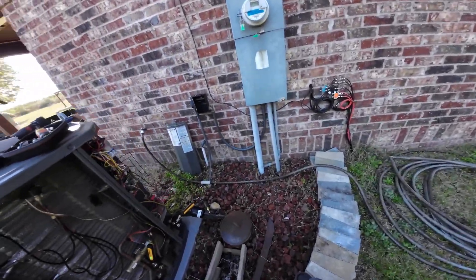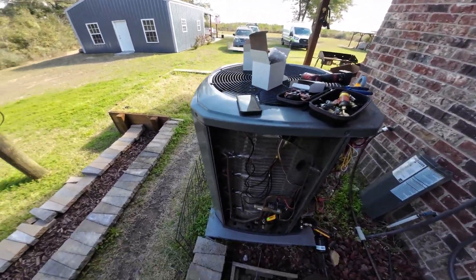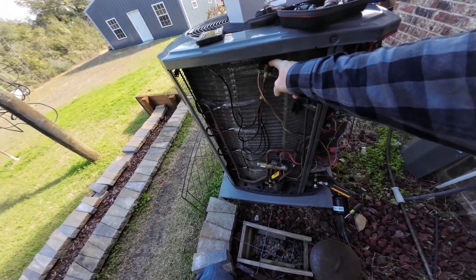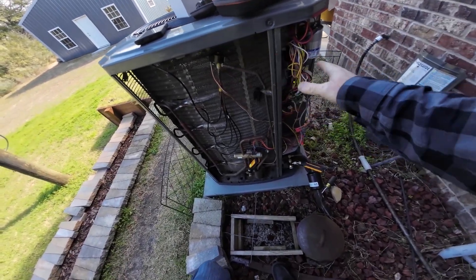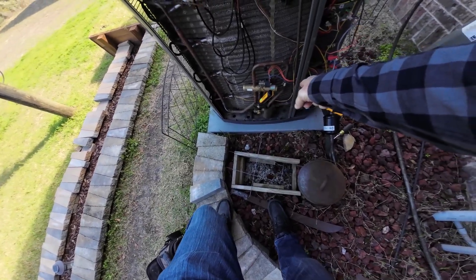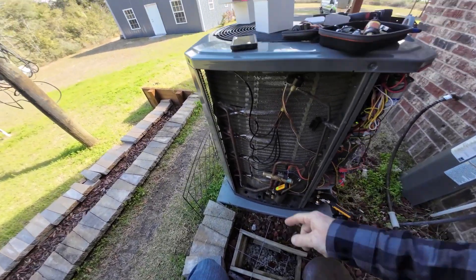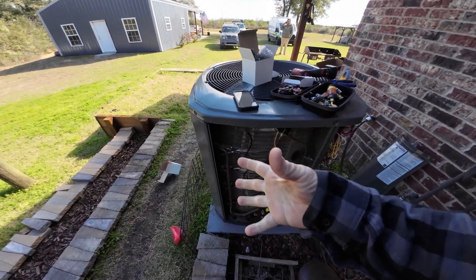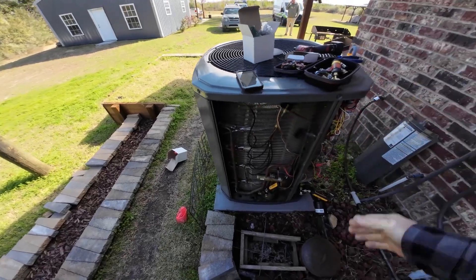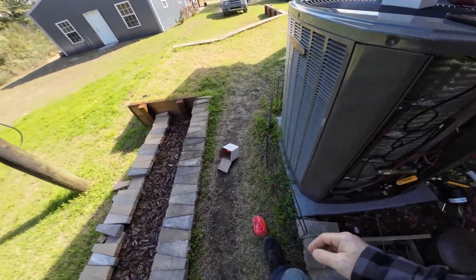All I do to test that: when you see it pumping down, you can test it open to see if it's the stepper motor. If all that works and you want to test the sensor, I just throw it over to the hot side where the refrigerant gets hotter — so temp rises quicker and forces that stepper motor open. It did, so I don't know what else to tell them.